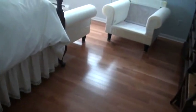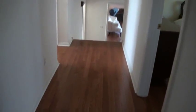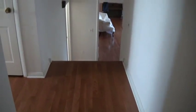This is the master bedroom. The closets needed to be adjusted accordingly, which we did. This completes the project, which was about five days from start to finish — ripping the carpet, removing the particle board, installing the plywood, and installing the new floor.